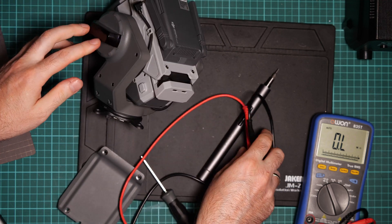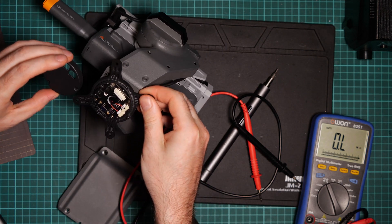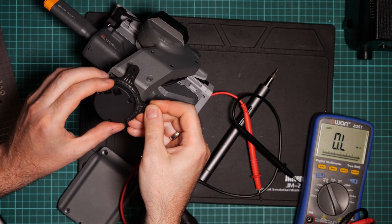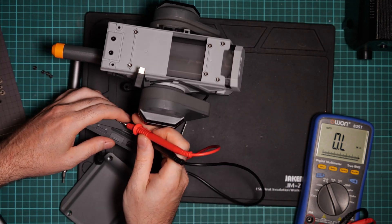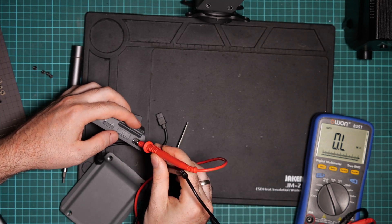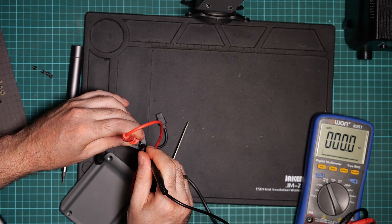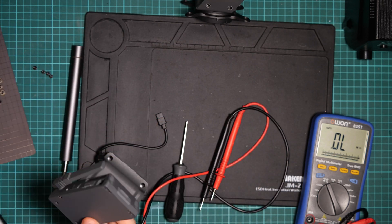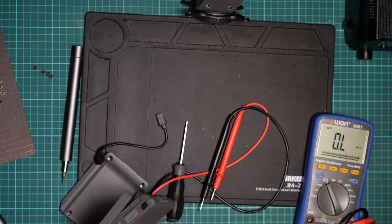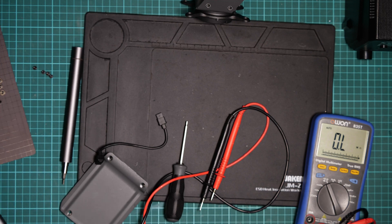Okay, so this thing is working properly, I'll close it to avoid damage. I can see that this is the second terminator resistor here inside this unit, and the other was in the motion controller — so these are both ends of the CAN bus.